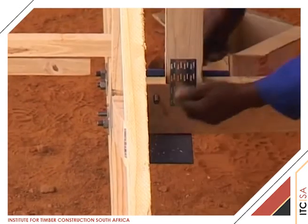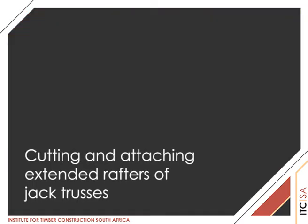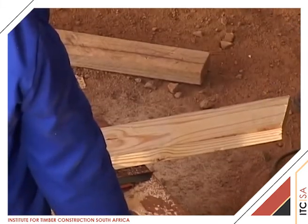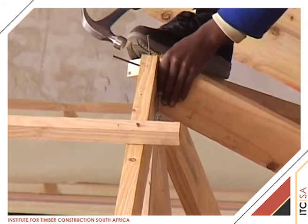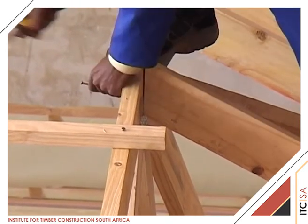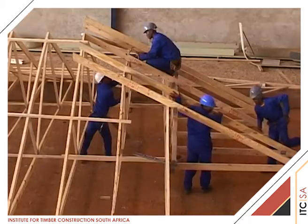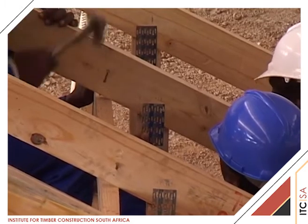The J1 trusses are now bolted to the two brackets. The extended rafters of the jacks are cut to length at the angle of the roof pitch to fit accurately against the apex of the first A1 truss and nailed through the top cord of A1 into the end grain of the rafters to hold them in position. These J1 trusses are plumbed and the extended rafters are skew nailed into the horizontal top cords of the truncated trusses to temporarily hold them in position.